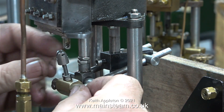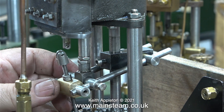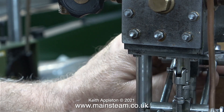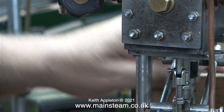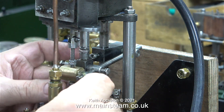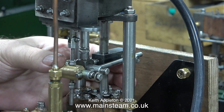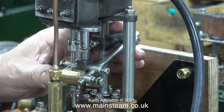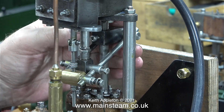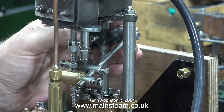Originally the allen bolt at the piston rod end was tightened into the groove, and after dismantling it, that's just what I did — I tightened it into the groove, only slightly, but obviously a little bit too much. Here I'm refitting the bolt that drives the mechanical lubricator, and I've tightened the bolt onto the drive shaft, so when I move the piston it doesn't feel right. I redid this part of the job by backing off the bolt one turn and then tightening the lock nut. Suddenly the mechanism felt a lot better.